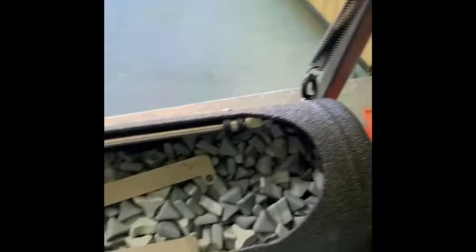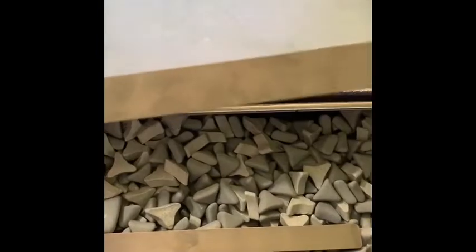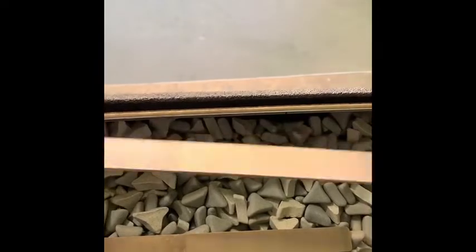The frame has springs — I just stuck these in here because I can pull it out and dump all the media out and change it. You don't want to be mixing stainless media with mild steel because it makes them look like this. This is stainless, so it kind of stains it a little bit.